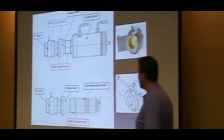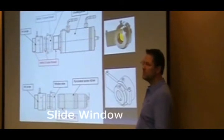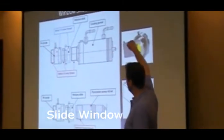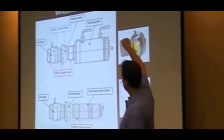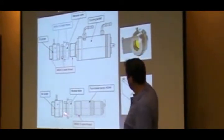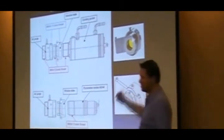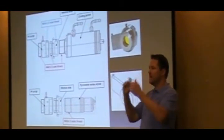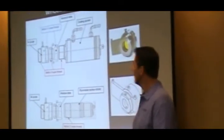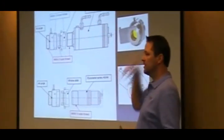About windows — on this particular jacket or sensor, there is something called a slide window. This looks like a lead sulfide window or zinc selenide because it's yellow in color — it's an infrared window. You can integrate the window within the cooling jacket, and it has threads on the outside so you can screw the air purge in front of it, or put it right on the sensor and screw the air purge onto the slide window. The windows slide in and out for easy cleaning. The window is also replaceable — undo a retaining ring and take it out.